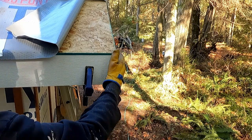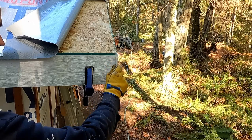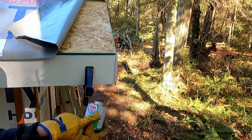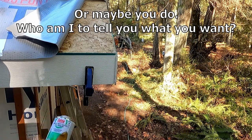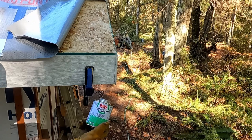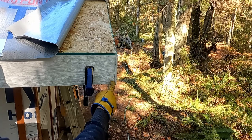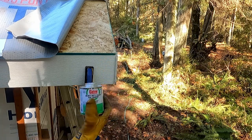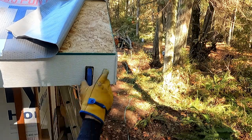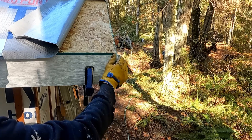Nothing's quite square and perfect in here, but I tuned up the cut with a handsaw a couple of times. The nice thing is the cement has solids in it, so the fit doesn't have to be perfect. You don't have to drive yourself crazy doing joinery with plastic, and it works really easy with hand tools. Use clear or white cement — you don't want a bright blue joint because that would look silly. This cement is a mixture of a solvent that dissolves vinyl and a bunch of vinyl sawdust, essentially, in solution — some dissolved plastic. The solvents melt the PVC, polyvinyl chloride, soften the plastic wherever you brush it, and then when you squish the pieces together they mix. As the solvents flash off and evaporate, the plastic solidifies and the new solids solidify, welding the entire joint.